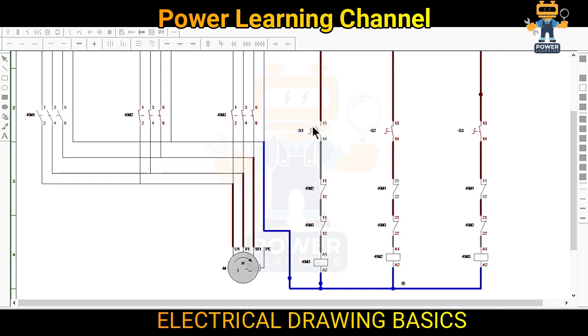Now I press these three — even so I will remove this. If I turn on KM2, it is on. In this case if I turn on the others they will not pass power. Only the first priority is on. Now I will turn on this one — you see these two are open, even if I press the others it will not affect anything. The motor is running.